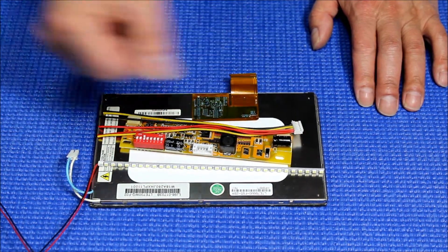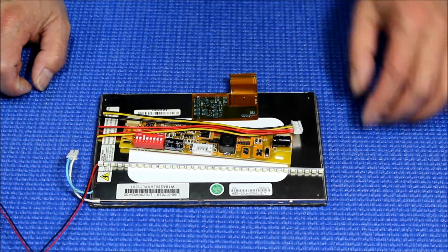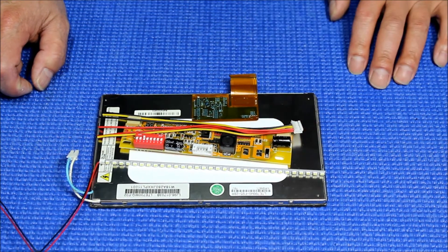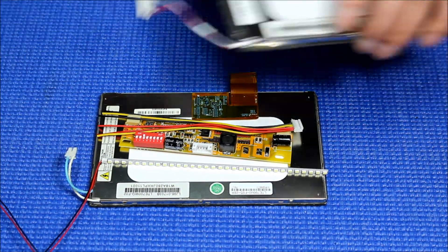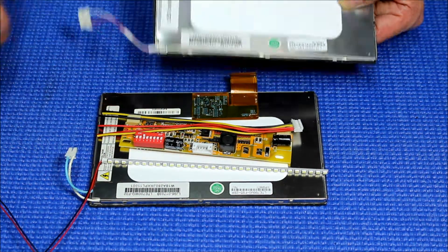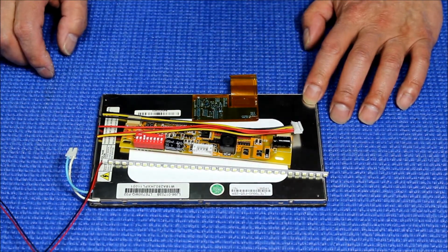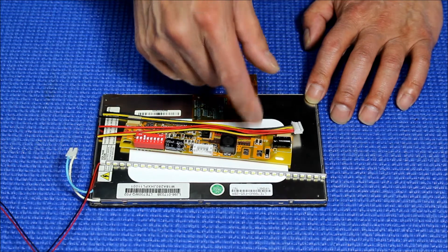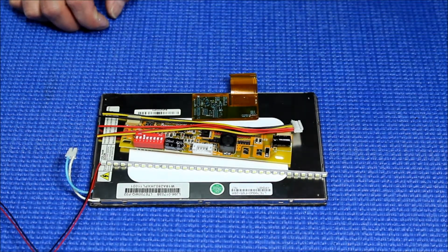This 7-inch is originally equipped with an L-shaped lamp, as you can see after I disassemble it. We have a kit — the UB35 series is specially designed for this type of 7-inch ATM machine. Most of them come with CCFL; some screens already come with LED, but compared with our LED, the brightness is not even close. The screen is made by Samsung. The screen part number is LTE700WQ-F05 — again, LTE700WQ-F05 — a 7-inch screen for ATM.